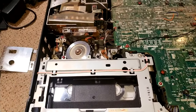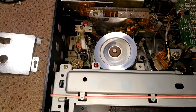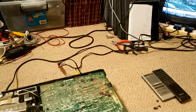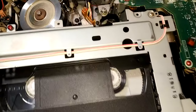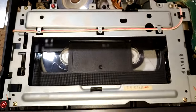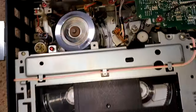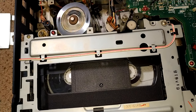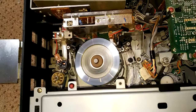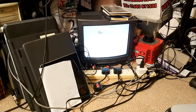I've given it a bit of a clean and that's why it tries to wreck some more tape. Now, obviously I've got this — you could argue it's the heads, but of course we know we've got no back tension. Let's see if we can encourage it to behave. Let's stop it before it starts wrapping too much tape around anything. Let's see if we can get a bit enough torque to actually play a tape — so far so good. Let's use my finger just to build up some torque.